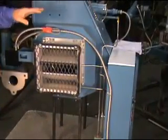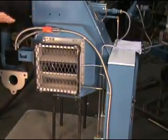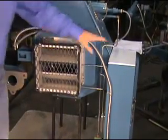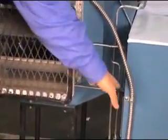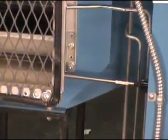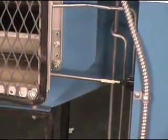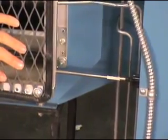We happen to have here a burner that's equipped with the ADT control system. What you're looking at here is a louver box and the control panel of a typical little burner. We have the air temperature sensor right here — that measures the combustion air temperature. Obviously it's close to the louver box so that it can actually sense the temperature of the air going in.